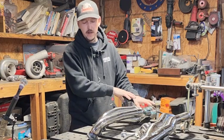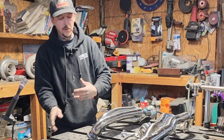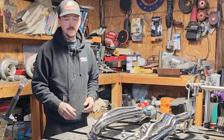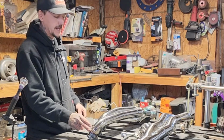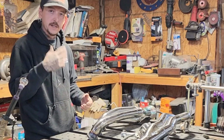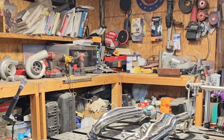It's heavier than air, and it's going to try to push it out like water. It'd be just like flowing water through this side of it. So that's what I'm going for. We'll go ahead and get these runners welded up, and the inside of our weld should look as good as the outside of the weld, in theory, if it's back purged correctly.